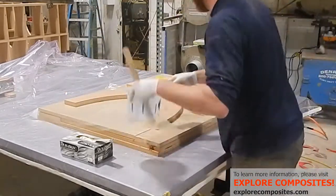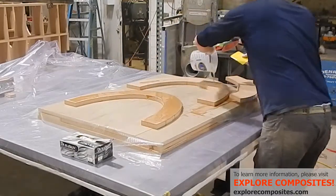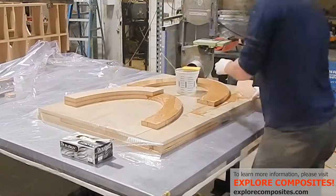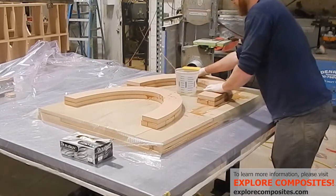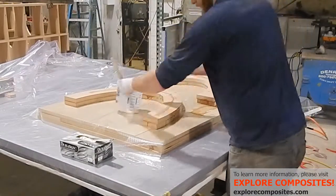These are some pieces that I've already machined to about a half inch bigger than they need to be for the final machining step. The base layer is solid but each stack going up is broken into pieces to make the machining more efficient. And I just stagger the joints when I model this up.